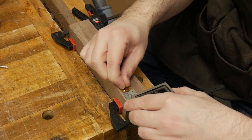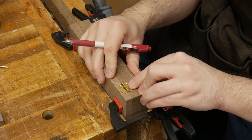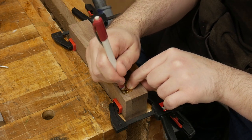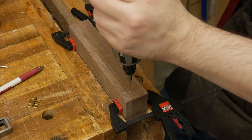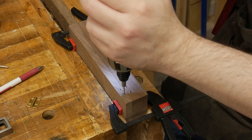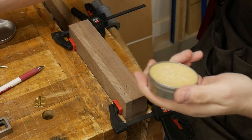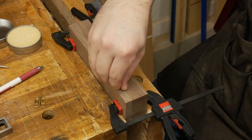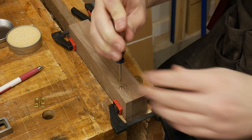I'm going to set these in a half inch from the edge, and I'm going to line it up. These are going to move, so it's probably going to take me a couple of tries. I do have self-centering bits, but it's going to be a whole lot easier for me to just mark them and then come back and drill them. I'm going to use the screw wax to screw these in. These are probably brass plated. They did not come with a standalone steel screw, so I'm going to use the screw wax when starting these holes.